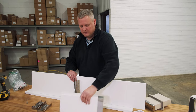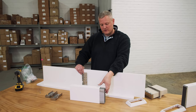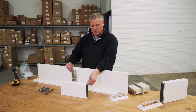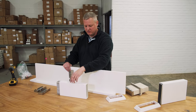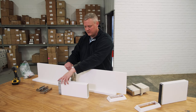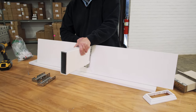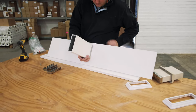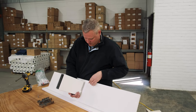Once that's installed, you can hang your rafters. The key to making sure the rafters are installed right is that the aluminum is flush with the back of your rafter. If the aluminum is pushed away inside, when you go to screw it you're only going to get into the vinyl and that's not going to be near as sturdy. So you want to make sure the aluminum is all the way flush, and this piece should just slide in like that, and then you're going to fasten in through the side of the hanger to the rafter.